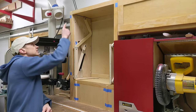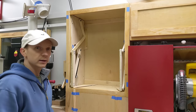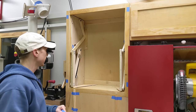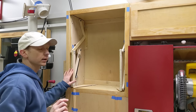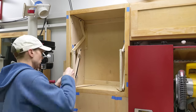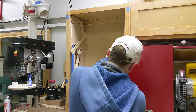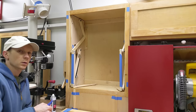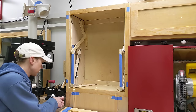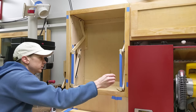I've also put pieces of tape on the corners, and that will help me line up the cabinet door left to right. Now that I've got the lift arms in place, I'm going to use a method that's often used for hanging drawer fronts — using some blue tape on both the link arm and the back of the cabinet door. Then I'll apply some super glue to the link arms and some accelerator to the cabinet door, and press them in place and hold it until the super glue kicks over.